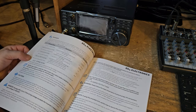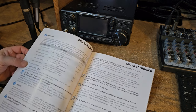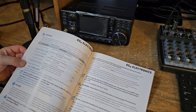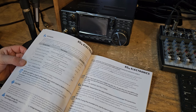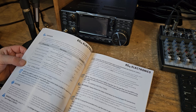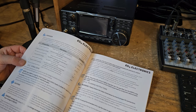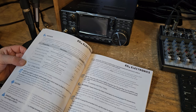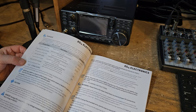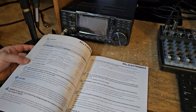Using the solar modules that have 40 volts VOC with a maximum amperage of 10 amps, 10 modules wired in a series string would have a VOC of 400 volts and a string amperage of 10. When the temperature is lower, the voltage can rise above the maximum allowed by the inverter and damage will result. So this is like serious stuff here, guys.